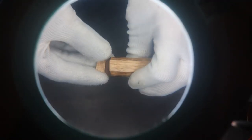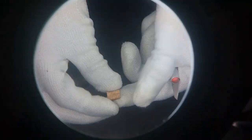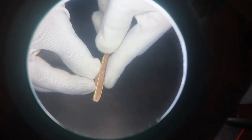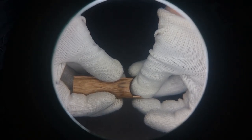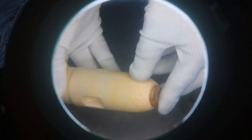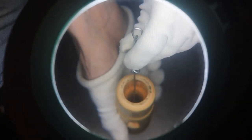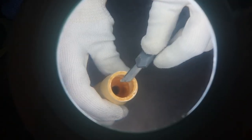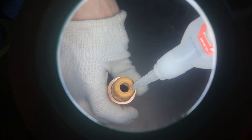So, back inside we take the small wedge that we cut off and we're going to fit it to the plug. And then you align the plug in just the right place, and using this contraption that I've basically stolen from the sound post placing things violin makers use, we can place the wedge just where it needs to be with some CA glue. And if there's a mistake, it's easy to bore it out again. And yeah, I think this design simplifies a lot of construction without necessarily any compromise.